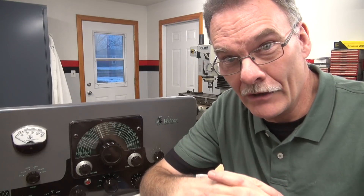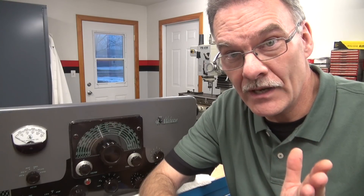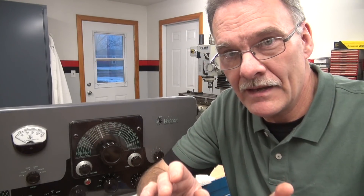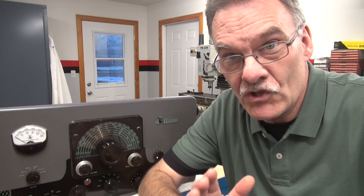You can find some fine reading on the web from WA1HLR, Tim Tron. He has some great articles about the failure of that resistor and how to repair it. But the reason I'm presenting this video is to tell you that it's critical that you change that resistor or verify that it has been changed, because even if your VFO is not working and you hook up an external VFO, that VFO is still powered and that resistor is in there breaking down and getting hotter and hotter, and eventually it'll actually catch on fire. It'll bake the inside of your VFO. So you have to check this.